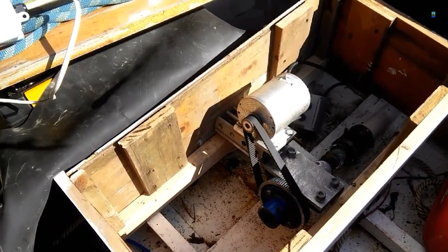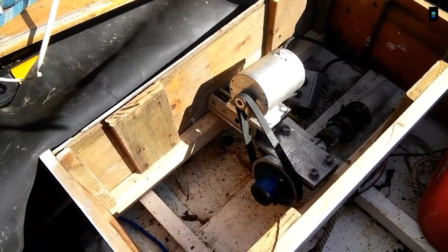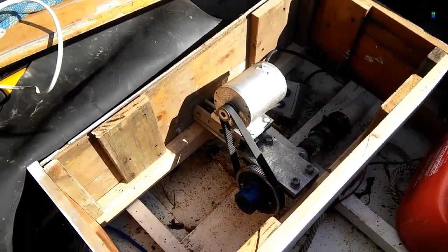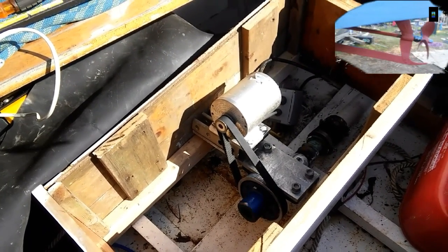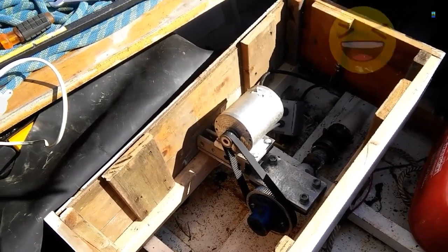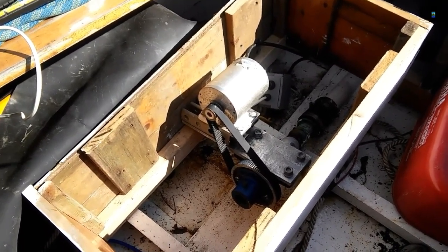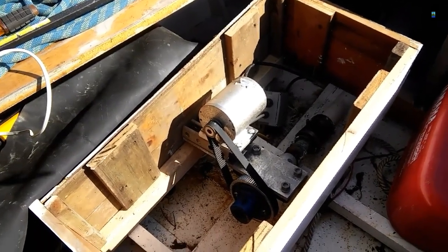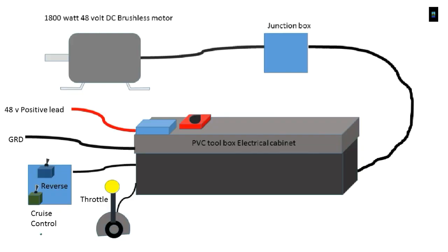Here's generation two, the belt and pulley system. It's a lot more quiet. I used some adjustable conduit hangers to make an adjustment so I can get the belt on and off easily, replacing the washers of the last design. I got a strong belt and I built a box around this so that it doesn't make the noise radiate through the ship.